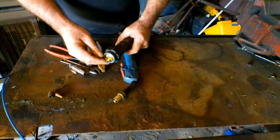Remember how we tested that switch with that bit of wire we made up? We've still got the wire hanging out of it here. So all you do is just put your wire back into your torch lead like that, push them in and screw them up again. Turn your machine back on, pull the trigger and wait for your wire to come out of here. Remember, we haven't reassembled this head yet. Here it comes — yeah, not stuck anymore. Beautiful!